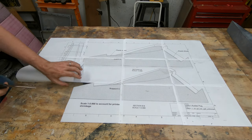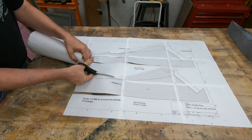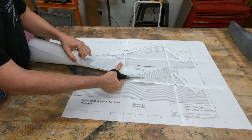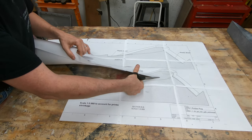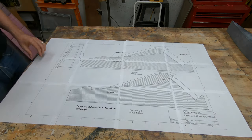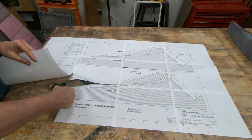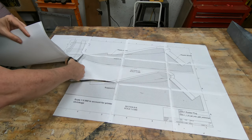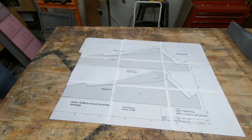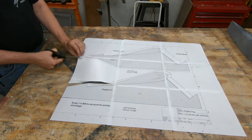But I wanted the plug to rest at an angle so the nose was kind of tilted up. That way when I flipped it over the mold would be tilted down — nose down — and the overlap area near the nose would be a little bit easier to get into with my hands and put carbon fiber and foam in there. I'd actually be able to see it instead of having to lean down and look up into it. So I decided to make a little cradle fixture to hold the plug in the position that I wanted.